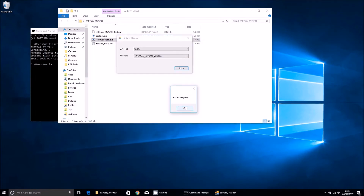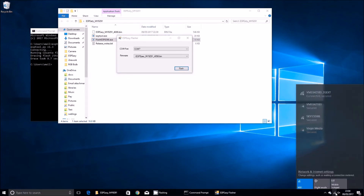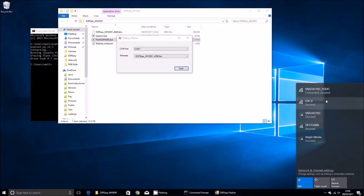So that should now be uploaded. I'll need to disconnect the bulb from the serial adapter, and plug it into a light fitting so it's powered from the mains — without the IO0 reset connection. I'll do this off camera — I'm going to de-solder all the wires to the bulb. Once that's done, looking at the wireless devices available, a wireless device has been created called ESP_0 — yours may have a different number but it will certainly have ESP in it. I'm now going to connect to that, which will connect me to the bulb itself.